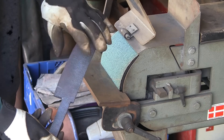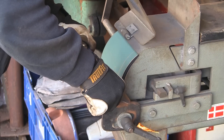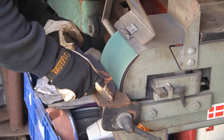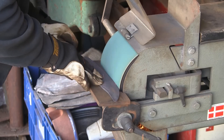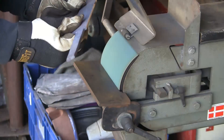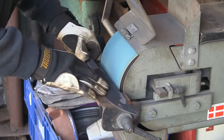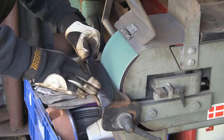I'm just going to do some real rough grinding on both sides, get a bit of shape into it. I've got 36 grit on here and it's quite worn already, so it's not going to be too aggressive. I just want to take the teeth off there because although I've hammered that out, there's still a lot of teeth marks in the bottom there and across the top. I want to take that off across the top because I might do a bit of file work there. This grinder is pretty aggressive and it just goes to show how tough rasp steel is - it's not tearing it off like it would if it was a bit of mild steel.